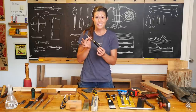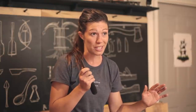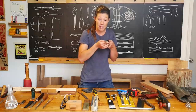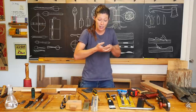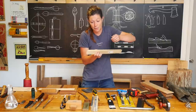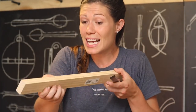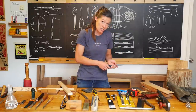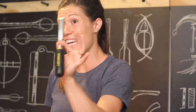A really important note we need to make is on safety. A chisel is the most dangerous tool — more ER visits happen because of chisel accidents than any other tool in woodworking, including the table saw. My friend Chris Swartz always says that we want to treat a chisel like a gun: we never want any of our body parts — or anyone else's — on the other side of the business end of a chisel. We are going to get in the regular practice of making sure all of our soft bits are on the safe side of the cutting edge. One of the most dangerous things I see all the time is people trying to adjust a piece of wood with no control over the tool and their fingers very close. In fact, my brother-in-law almost cut off his thumb because he knocked his chisel off his bench, went to grab for it, and accidentally caught the blade. We need to take safety and chisels very seriously.